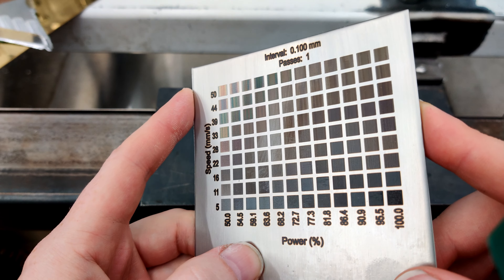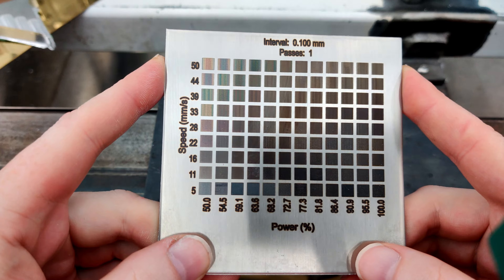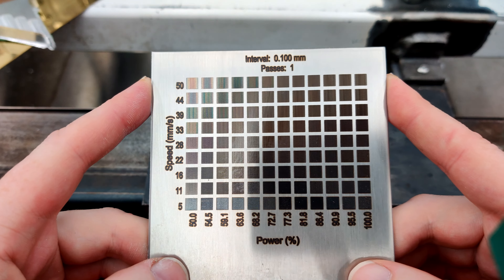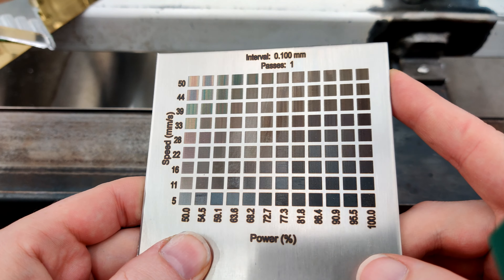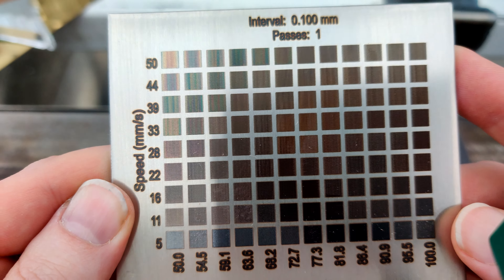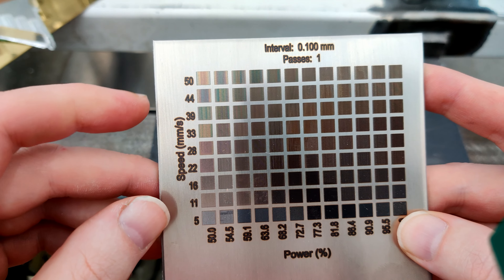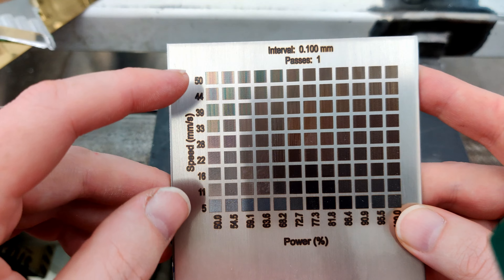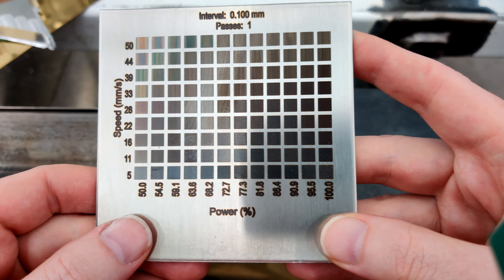It's slow though, but it doesn't cost $5,000. This took me at least half an hour. But you get a big build volume — roughly 400 mm square. With a fiber galvo laser you're kind of limited to about half that, unless you put it on a big giant CNC gantry. I'm pretty impressed. Doing a test with some faster speeds — maybe down to 40% or even 30% — to see how the colors trail off. This is certainly taking care of the spectrum on this end, and it's definitely etched into the surface. Here's a piece of brass to scratch test it and pick up some sound. Yeah, that's totally in that surface down there. At the top corner you can't really feel anything, but down here I can feel it — it's totally in there.